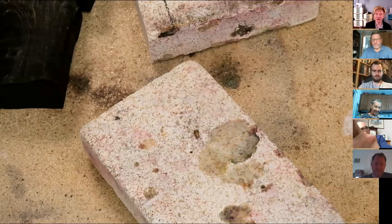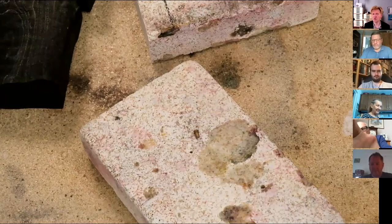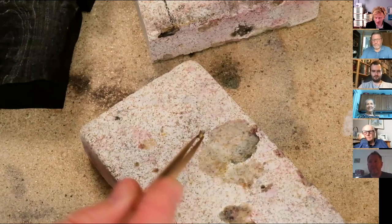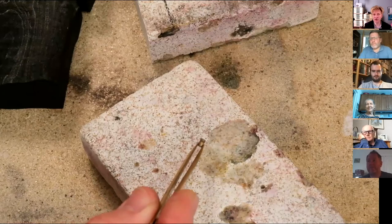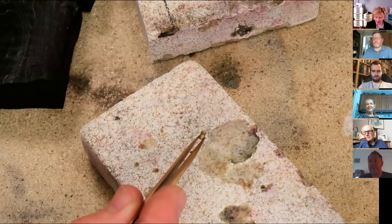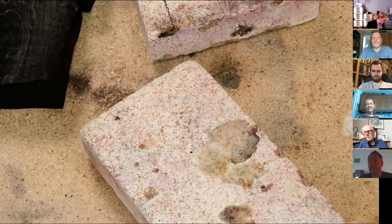Now it's slightly different here, because what we want to do is make this bit of brass as malleable, I think that's the right one, I always get my malleability and my ductility mixed up, but as malleable as possible, so we can squidge it down and rivet it. We're not bothered about the mechanical strength per se, it's going to be fine. It's a small piece of material, so it'll have cooled down-ish. We could put it in cold water, or we could leave it to cool naturally.